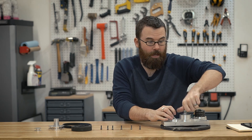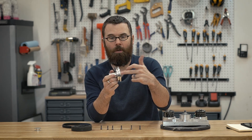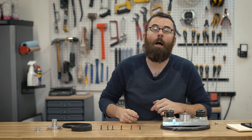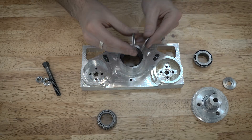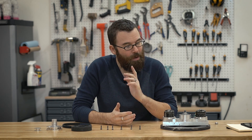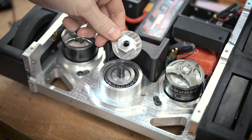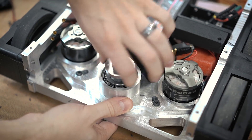The last thing to mention is the washer assembly up here. There's a 3/8-inch bolt that goes through here and compresses the whole stack. The bolt is not there to hold the weapon in place — it's there to hold the bearings in place. In the very first fight, I noticed the weapon was loose and got scared, but it turned out the washer had just cupped in from so many hits. I added two washers — they cupped. I added three washers — they cupped. So for the next version, I'm going to get rid of the nuts and washers and make a big hub out of titanium — basically a half-inch thick titanium piece that screws in there. That should solve the issue.